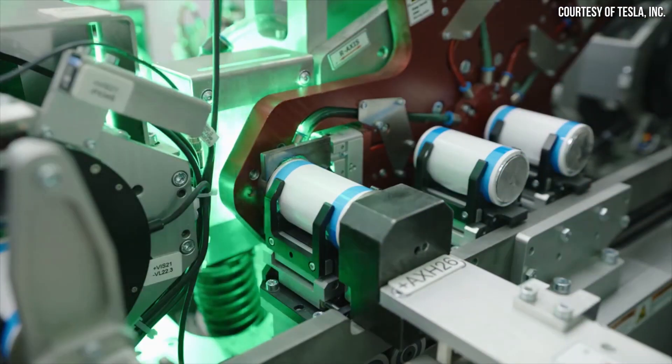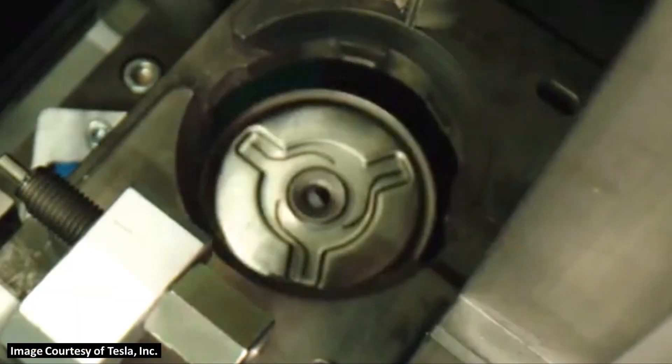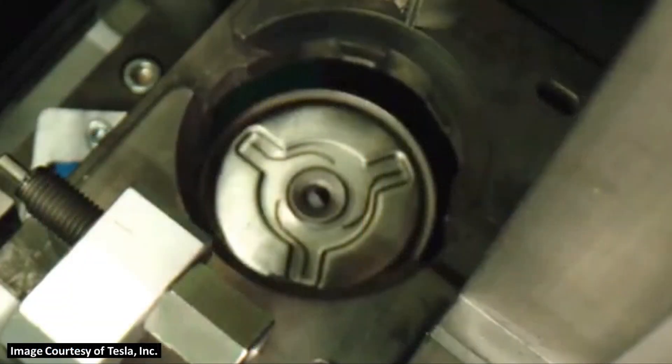This welding process appears to be what Tesla is demonstrating in their video. It was also suggested that the removal of the additional current collector plate should make room for a slightly taller electrode jelly roll, which could improve the energy density of the second generation 4680 battery cells. This new design change could also be related to Tesla's 3-in-1 machine development, as this kind of manufacturing simplification would make such a combination machine more feasible. Additionally, the center divot in each battery cell is where electrolyte is added before the cell is completely sealed, and it also includes an advanced pressure release technology designed to help mitigate potential cell and battery pack damage should a thermal runaway event occur.